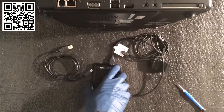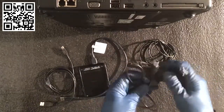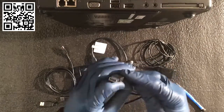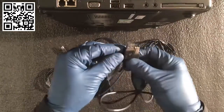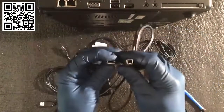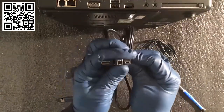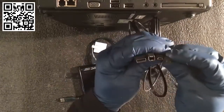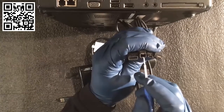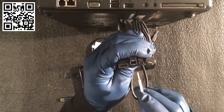Let me start with USBs and talk about the mini USB. When I look at the different types of USB connections: this is called a Standard A plug and this is a Standard B plug — these are really common, you'll see them on printers. The Standard A end connects to your laptop or desktop and the Standard B end goes into the printer. This is called a Mini B, and this is a Micro B. So I've got four different types here: Micro B, Mini B, Standard B, and Standard A. All different types of USBs — and you'll see these in different colors. These happen to be USB 2.